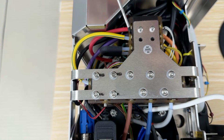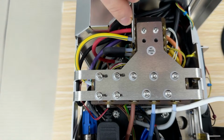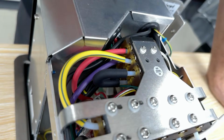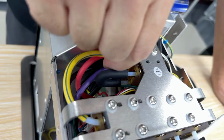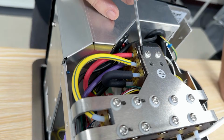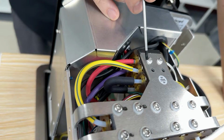Now, I mentioned the removal mechanism for these tubes. Right here, if I put that screwdriver underneath there and I pull that tube out, I pull this clip out, this tube will pop right out, and you'll see a little O-ring. And the beauty of this is that this seal right here, for example, is actually not currently water sealed. It's now loose, and it's loose because the machine is cool. And as soon as any water comes in, the O-ring in there instantly seals it. What that does is it prevents the enemy of espresso machines, which is thermal cycling. As things heat and cool down, if they're different materials, they expand and contract at different rates.